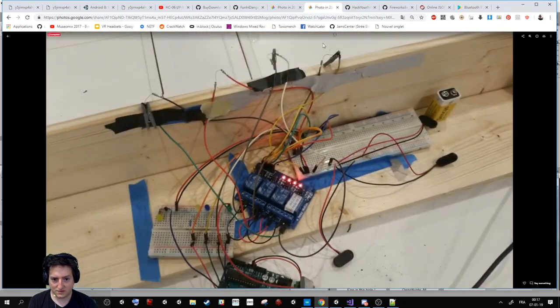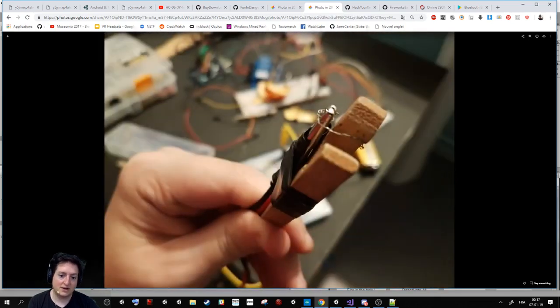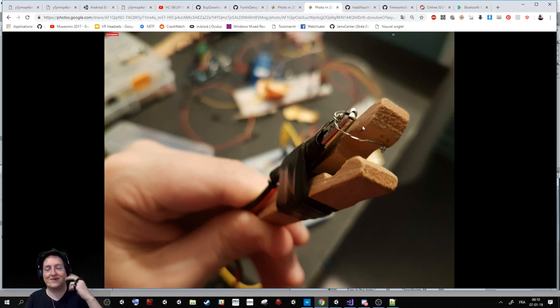So, what's happened here? Okay, here. So, for example, that was something cool: I use a cable to be able to burn the fuse, but the problem is that the cable breaks easily. So what I did, you can see here, I used two cables, one on top of another, but the problem is that you need more power. If you need 1 amp for one cable, you need two to three amps to burn both of them because they are sharing more surface. So, good idea, but bad idea because I need more power.